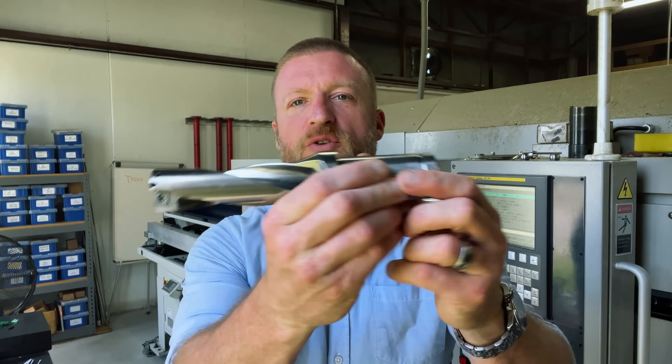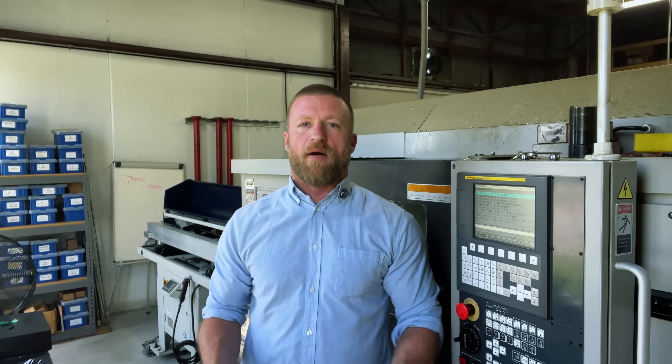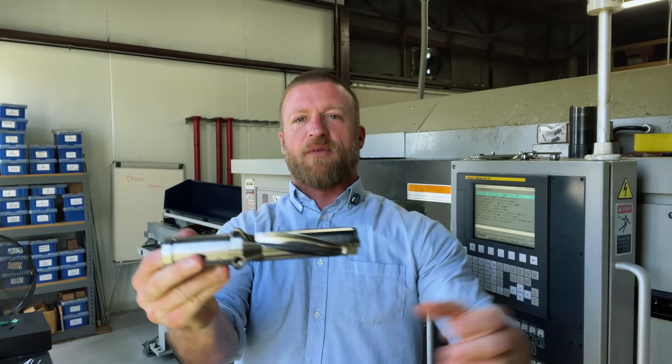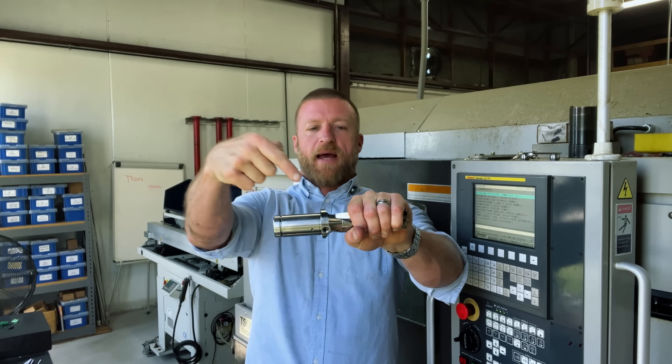Now in a perfect world, every tool, every operation, every machine would have coolant through the drill. We have some machines here that are through-spindle coolant and some that aren't. You have your coolant directed either through spindle — which is piped into the back and comes out the flutes — or if you don't have that, it's what we call flood coolant, where the water is directed at the drill from the outside. When you're deep hole drilling and you don't have through-spindle coolant, the bottom of your drill is dry. There's no flood coolant that's going to be able to get through, and any that does will not be efficacious enough to properly cool the bit and flush out the chip. For that reason, I really like peck drilling cycles.